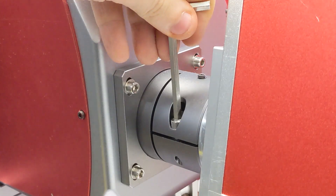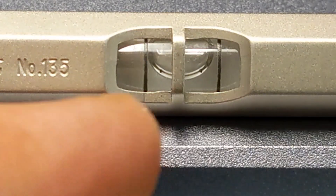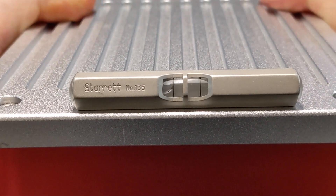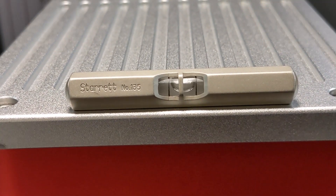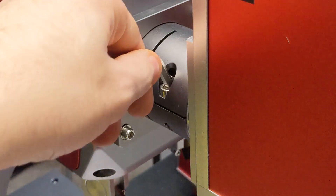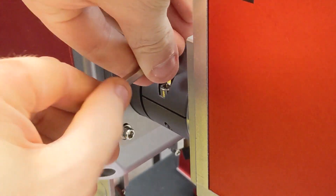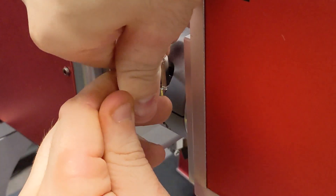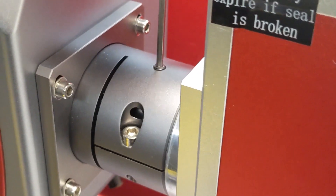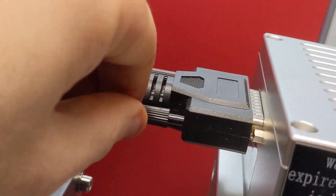You don't want to level the Galvo head with the ground. You can see it's a little off — that's okay. We just need to know how level the bed is, then match that to the head. I've moved the square up to the Galvo head and we're just moving it back and forth until it matches. Now the bed and the head are offset the same amount — that's really key. I have a video covering that with the CO2 Galvo alignment. With that done, tighten the clamp all the way down — we don't want this head moving. Tighten down the little bolts too, then reconnect the serial cable and tighten that back up.